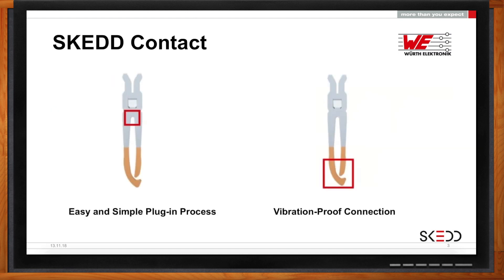So how do we accomplish conductivity with a solderless connector? The contact has a Y-fork on the top half, allowing the ribbon cable to have insulation displacement. The bottom has a selective gold plating, where it creates termination against the via with a spring effect. It is vibration-proof because it has the ability to flex inside the via — pressing outward into the contact. How do I know it's going to not vibrate loose or glitch up my signals?